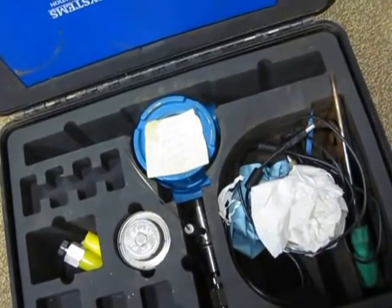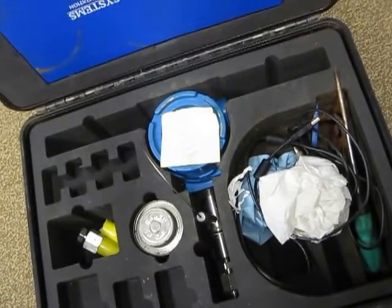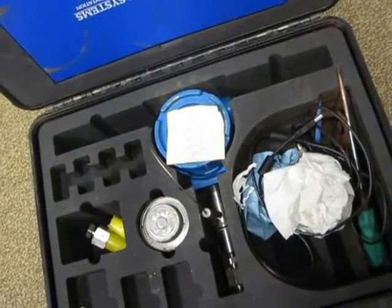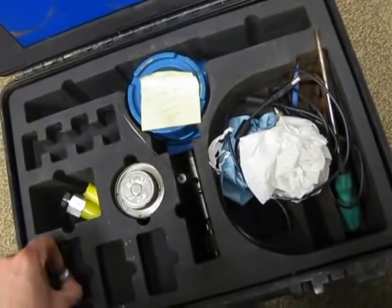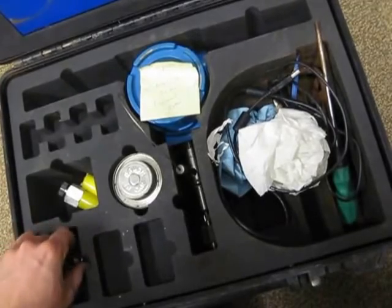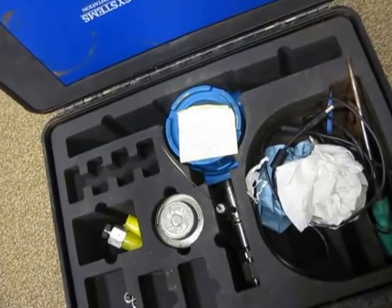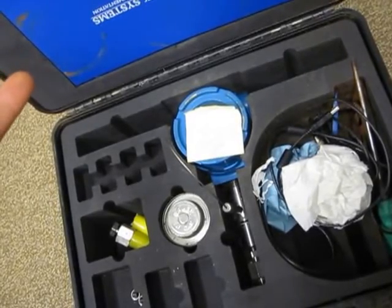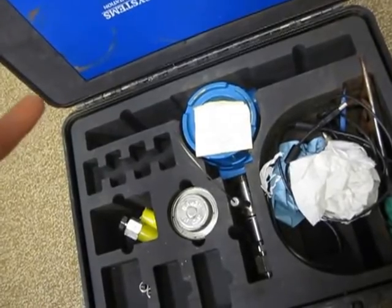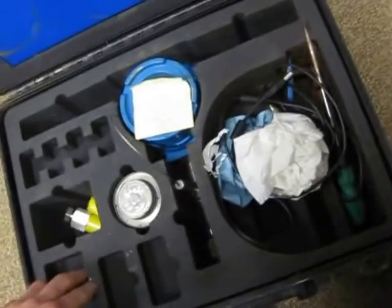When you do take this off the well, it's important that you know which well it came off of. If you have three gauges and three wells and you're not sure which gauge goes to which well, it kind of makes the D-fit data a little sketchy — we're not sure which well to correlate it to, and it makes our job a lot harder, and makes your job harder too because you're going to have to recall all that information. So if you just put a post-it or some kind of note on it saying which well you took it off of, it makes everyone's life a lot easier. You should also have a pump data sheet that you submit to someone with all the information for the D-fit: how many barrels you pumped in, what was the rate, what was the pound-per-gallon brine that you put downhole, and all that.